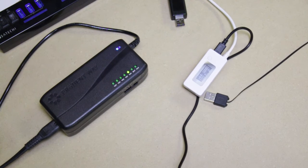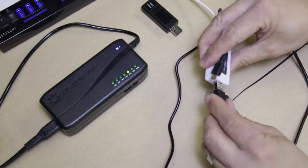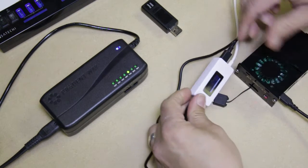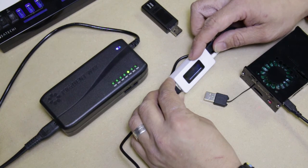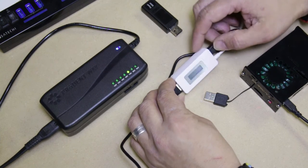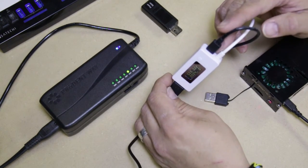Let's try attaching a Raspberry Pi to it. This is the new Pi 3. It drops down to 5.61 volts, drawing 130 milliamps up to 300, then 230 milliamps, sagging down a little bit to 5.56 volts. Very nice and quick update. I really like that feature of being able to plug in the external power.